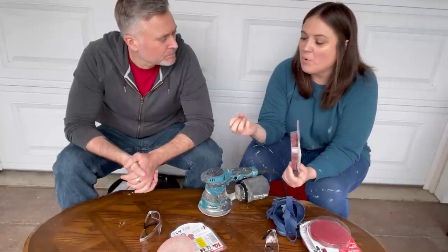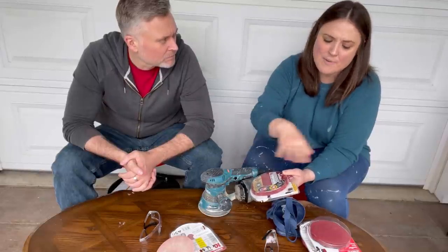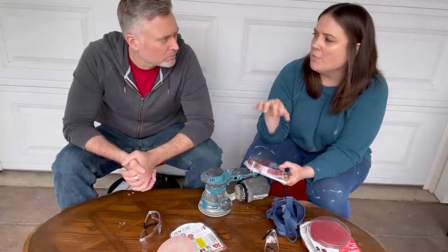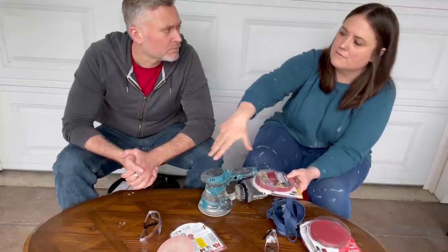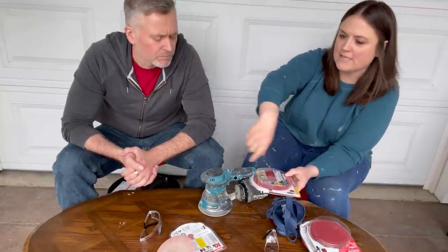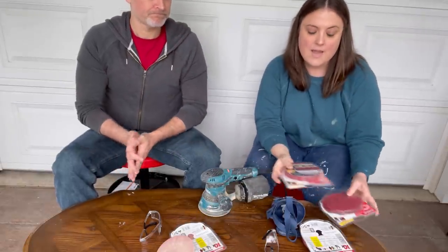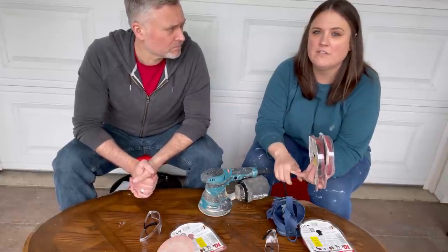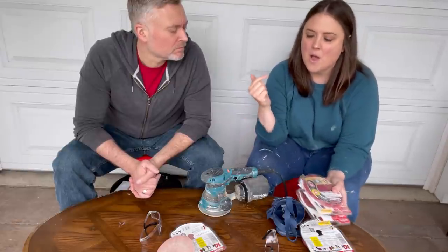Smooth it out. It's all about the pores in the wood. You're opening all the pores in the wood, and there still will probably be a lot of unevenness after the 80 grit. So then when you go in with your 120 grit, your pores are still open, but you're just getting rid of any nastiness, any black spots or unevenness. Now by the time you get to, and you know what, I would actually use a 150 grit, I just don't have it. 150 grit would be next.